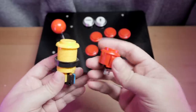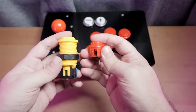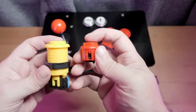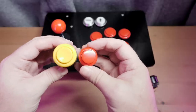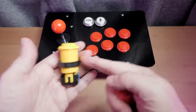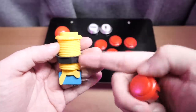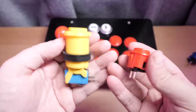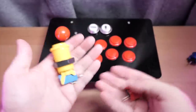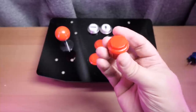However, this is the button that came with the kit I bought. It is Sanwa in style, but let me bring it up to the mic — as you can hear, it's a very clickier button. The activation force feels a lot lighter than the HAPP, but it's still much heavier than the standard Sanwa style, and you still get that lovely click. A little bit smaller for my taste — I like a bigger button — but I had to use these because the micro switch on the HAPP bottoms out; it's too tall for the panel. I was expecting these to be mushy Sanwa-style ones, but they're actually quite acceptable for now. I may do a rebuild with a custom deck tall enough to fit the HAPP buttons as a future project.